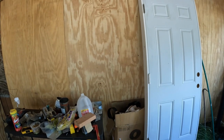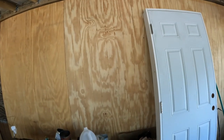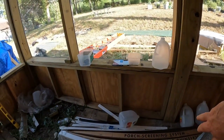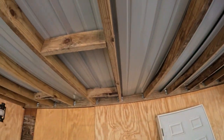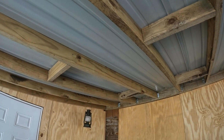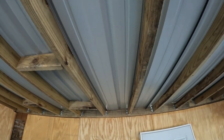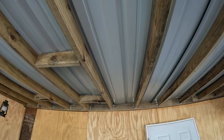I know some of you are like, that's not code. We ain't got no code. But I was in here the other day in the rain, nothing's leaking, and some of these ain't even screwed down yet. But I'm gonna take some of that shiny corrugated tin that I have on my kitchen ceiling, and that's gonna go across these bottoms. And I'm either going cedar up here or with that tin. I think the tin, and I may insulate it with maybe that thin stuff just to deaden the sound of that rain on this thing, though it probably will not need that. The reason for that is there's a deck right above it, and that's going to break all the force of the rain, so it's just going to trickle down onto here.